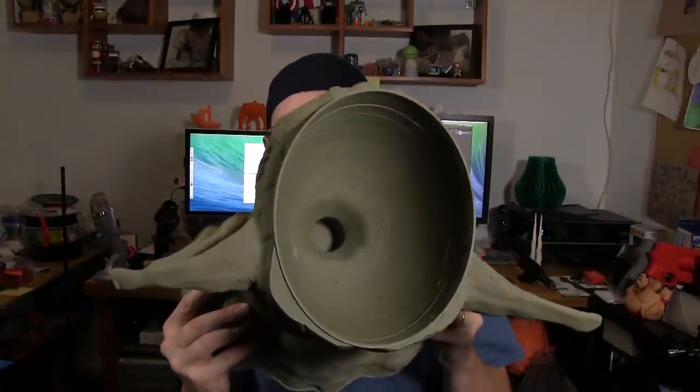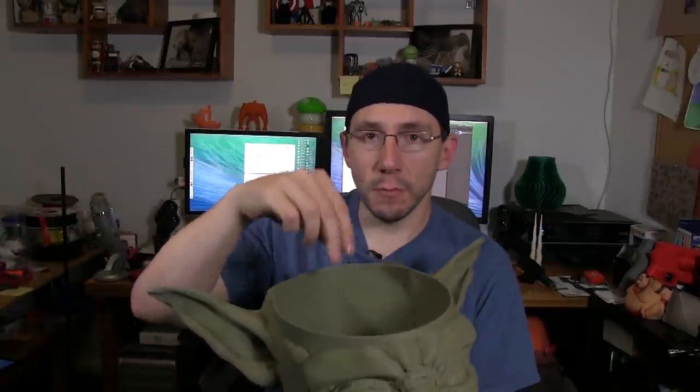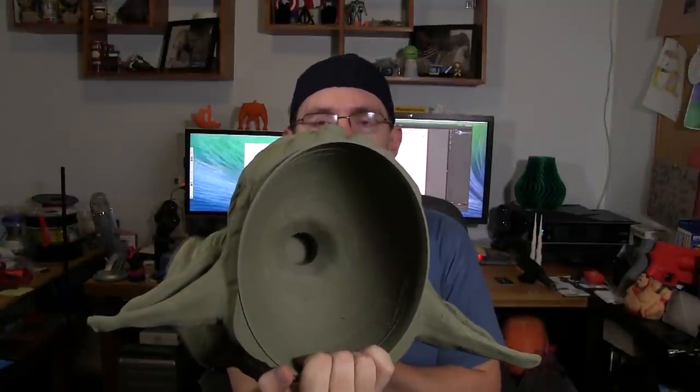Here is the bowl shape and you can see that there is kind of a tubular hole at the bottom. This model is built to be printed with no internal infill — it's a completely hollow model other than the perimeters of the inside and the outside. We had to be able to attach this inner bowl to the rest of the model while it was printing. So I printed with a couple bottom layers, and that tube at the bottom was printed so that it had something to hold onto as it printed up, then the bowl printed. The model itself would be able to hold on and not shake too much as the printer's Y axis — the bed moving back and forth — moved the model. It turned out to work really well.